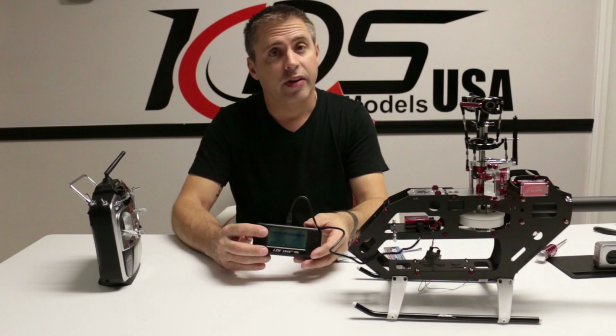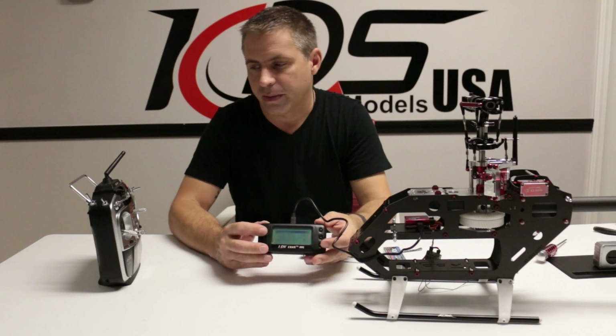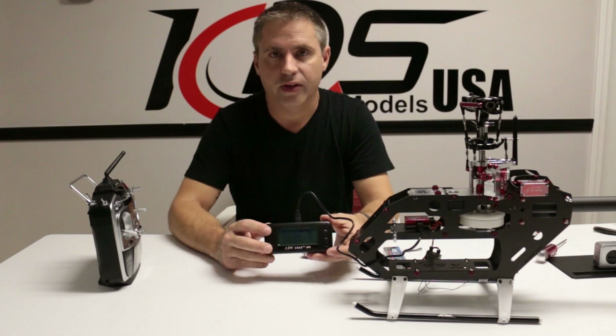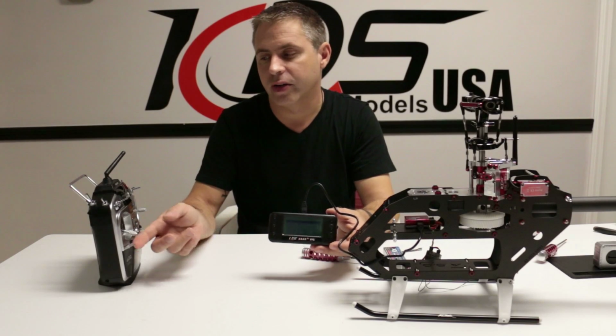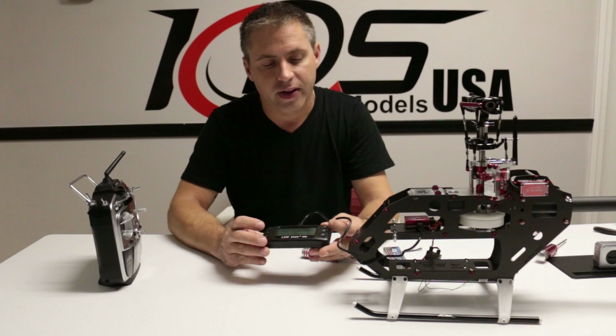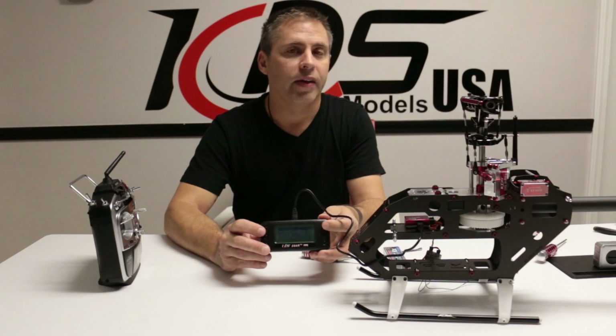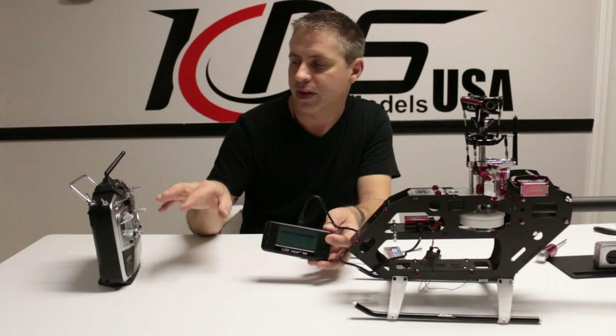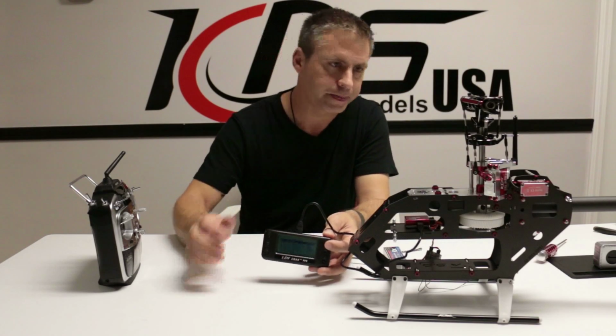After we've done that, our next step is to check plus and minus pitch. I'm on 0 here. You'll notice my stick is not doing anything now. I like to move my stick all the way up and then just tab up 1, and that will go to full pitch, or wherever you left the stick. That keeps you from giving it any unnecessary stick inputs.